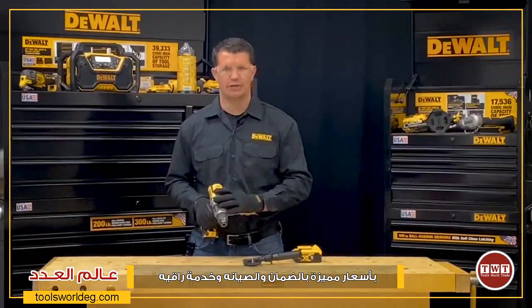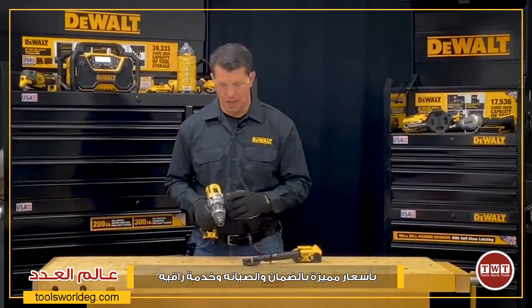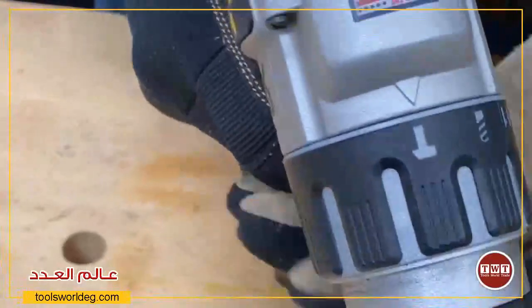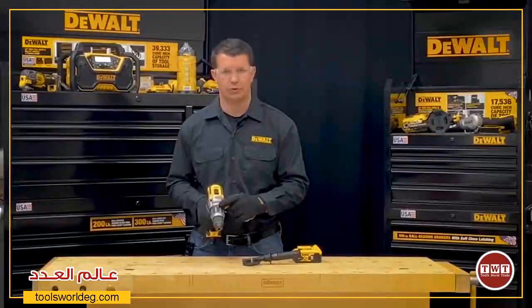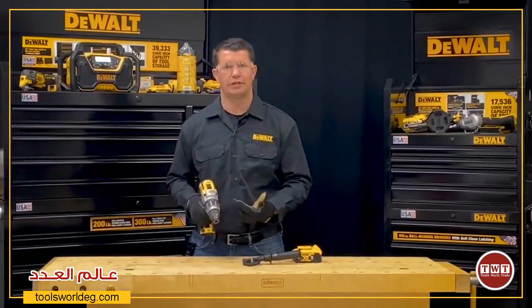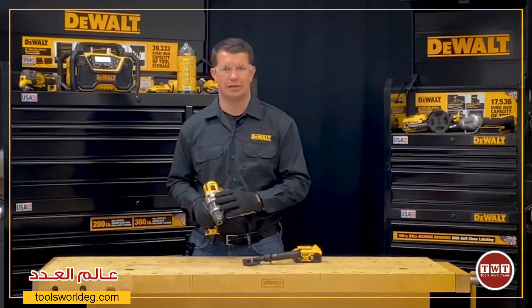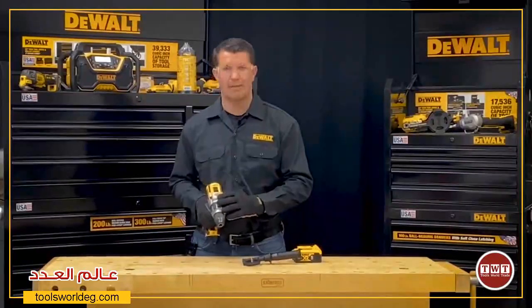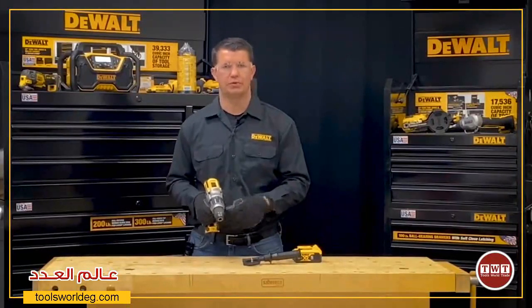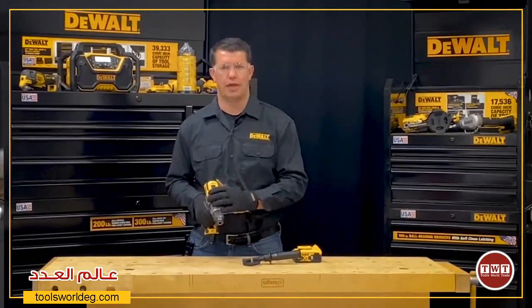Remember, I always want to operate this tool using the side handle, which I'll show you how to install in a moment. Another setting on this tool is hammer drill mode — I adjust the clutch collar so the arrow aligns with the hammer icon on the tool, and that allows the tool to actually beat while it also spins for drilling masonry applications. On hammer drill mode, the clutch is disabled, so you need to maintain a lot of control by using the side handle and the variable speed trigger, in case the tool binds up, because it will not stop in either drill mode or hammer drill mode.